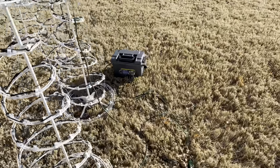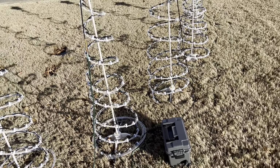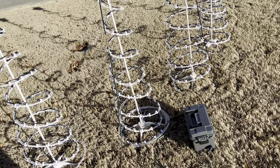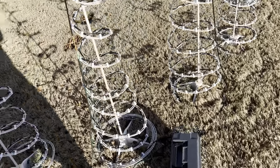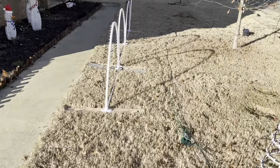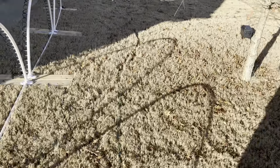These are again controlled by another 4-port differential receiver. Had kind of the same issues with finicky data. Anytime I had one of these 100 pixel trees chained to one of the smaller ones, the smaller one would always flicker. So I just didn't like that at all. I had to deal with that best I could, using extensions as short as possible. I tried an F amp, that didn't work. So I'm just going to use smaller controllers next year instead of these differentials, and I'll just run it all off Wi-Fi. No big deal. Just using my K32 as a master and push all these as remotes.